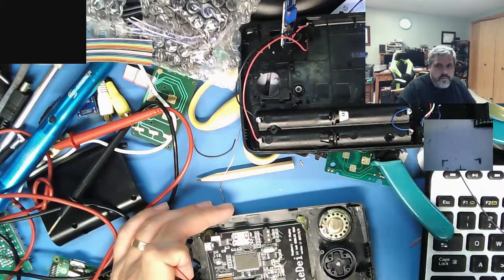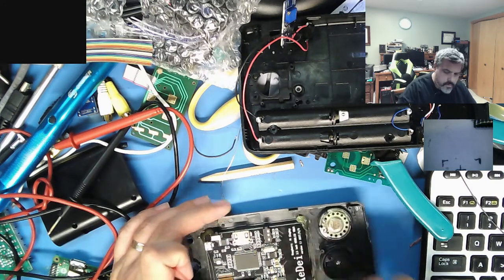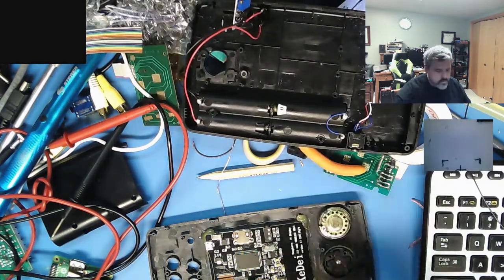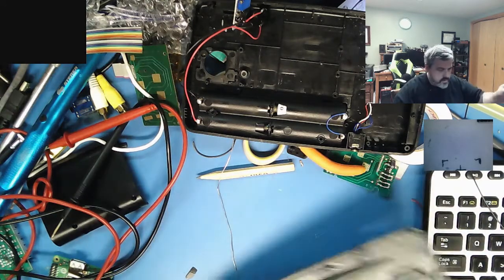So if you ever look at an audio plug, when you plug it in, it's stereo. The tip is left channel, ring is right channel, and then ground is the sleeve. So it's TRS. If you ever see TRS, it means tip, ring, sleeve. So the tip, and then you have your ring, and then sleeve. So I'm just going to hook up the left channel to the speaker. Then I'll run the full stereo out to the headphone jack, which is right there. But for now, I'm just going to run the tip. So yeah, the tip and the sleeve to the speaker and see what kind of...